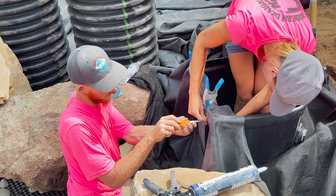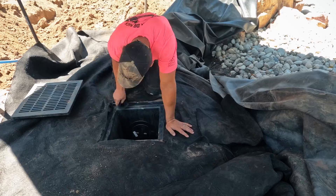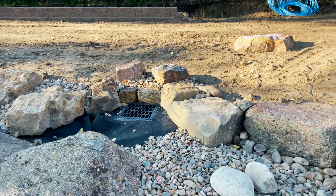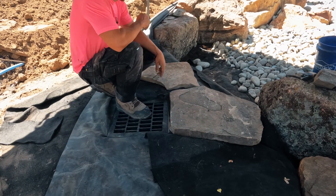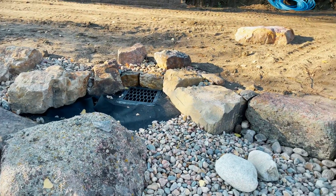There's even a skimmer in the back there to help pick up surface debris. As the water level goes up, it will seep into that area. Our method of installation is that the basin is set two inches below water level. The reason for that is because we're going to come back in with flagstone and mortar some thin flat work right around the outside of that, which will put it up to exactly water level. Then the water will slide and drop right in. We don't like using cobblestones or river rocks or anything like that in those areas, because I don't want anything that's going to trap leaves. We want to maintain perfect elevations for the overflow.